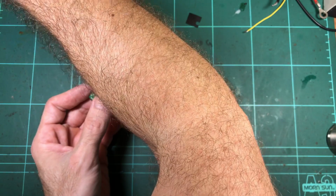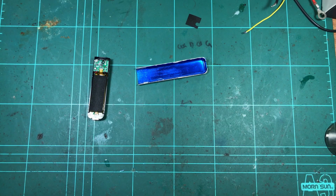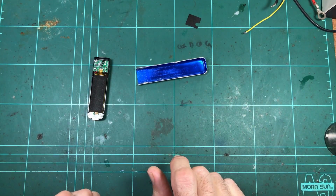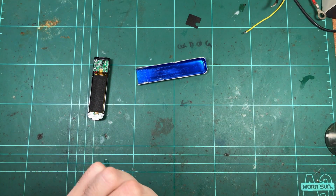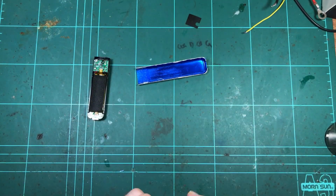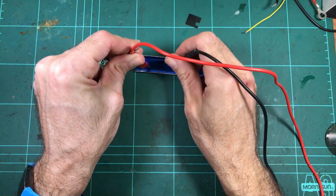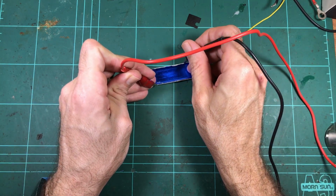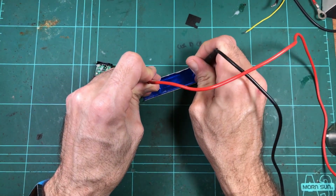The anodized metal is generally not conductive through the oxide layer, but it's super thin, that oxide layer. Like, it doesn't take much to scratch it off. I mean, it's not going to be moving around because it's glued in there. It's not going to have any sort of frictional forces there, but still, I'll put my multimeter on ohms, on buzzer so you can hear if this has got any continuity. No, that reads open circuit. Now if I go into the fresh alloy, there we have continuity, but through the anodized layer, nothing. See how much it would take to get down to conduction.